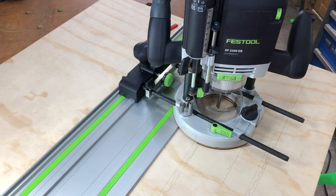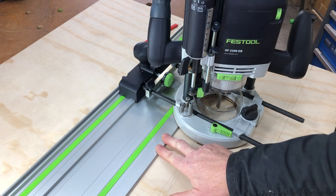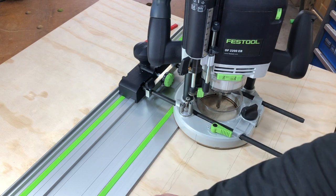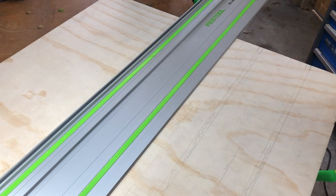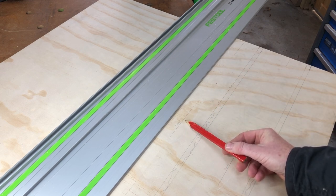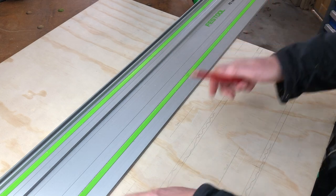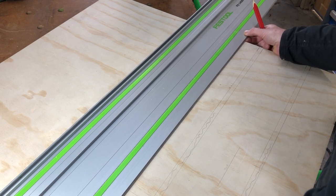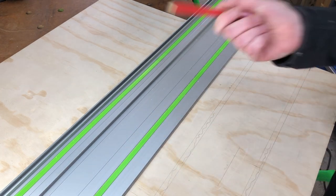The router bit is somewhat offset from the track. You could run the bit hard up against the cutting edge that the saw uses, but you'd just chew it up unnecessarily. So I mark a couple of points — one at either end and one in the middle — and these are parallel to the dado, which is very important. I then align the track with those lines, clamp everything in place, and move on to the next step.